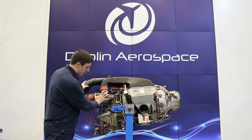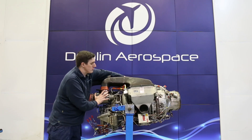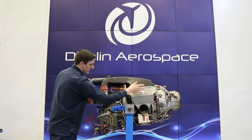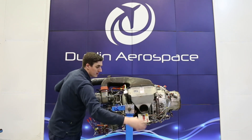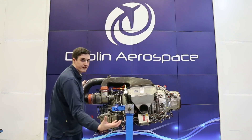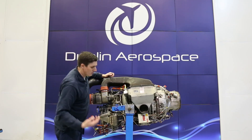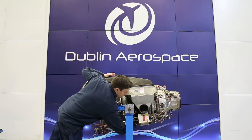There's a gearbox-driven cooling fan here which is pulling air in through an inlet panel. The air comes in through the inlet panel, through the fan, over the oil cooler, and is discharged outside the aircraft through here and then down into a flange on the aircraft itself. The air for the actual engine and for the load compressor goes in through the underside here.